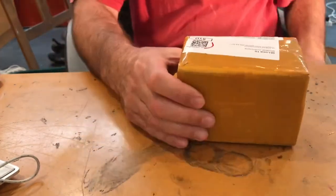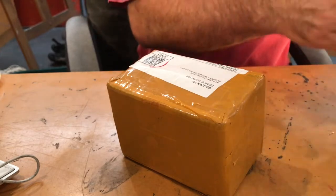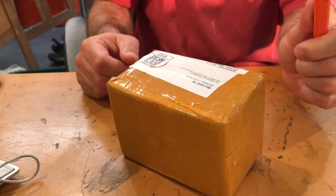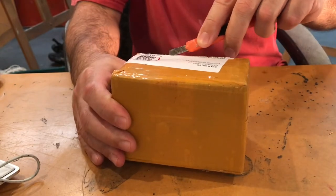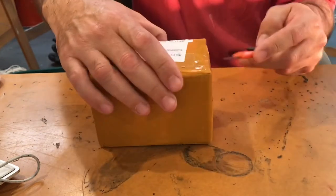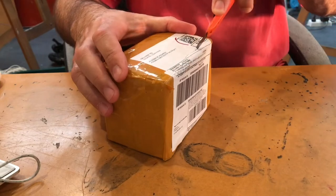That is the nano VNA vector network analyzer — it's certainly something very handy to have. I'll be able to plug it in once I build my L-match and analyze what happens when I adjust the L-match to find resonance on my antenna. Another exciting thing that arrived in the mail: I am building an old-school antenna tuner L-match, and I really needed a decent variable capacitor. These have become more valuable over time as there aren't many being made. I bought this one second-hand from Poland, so I'm hoping it's in decent shape.